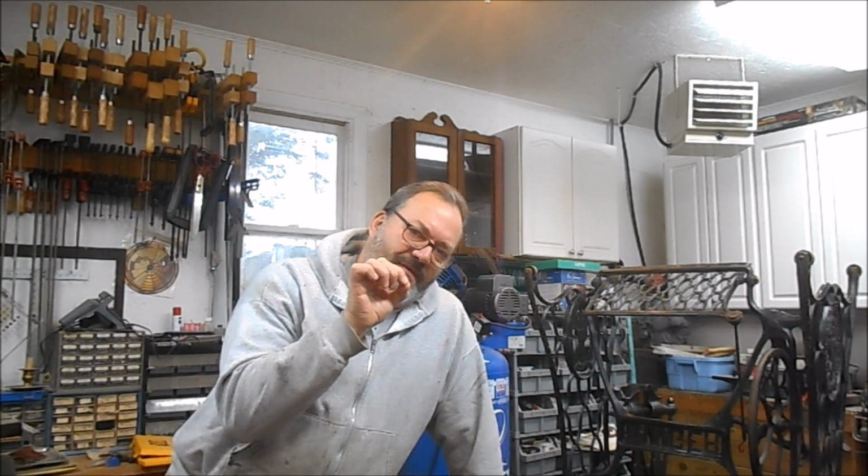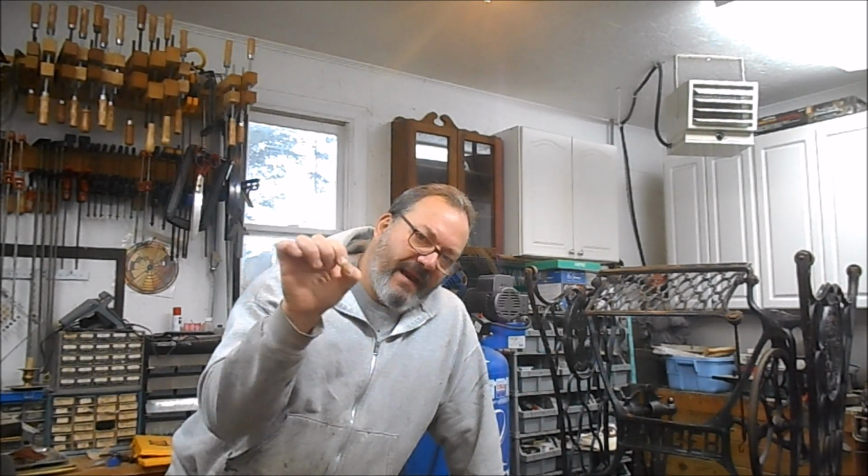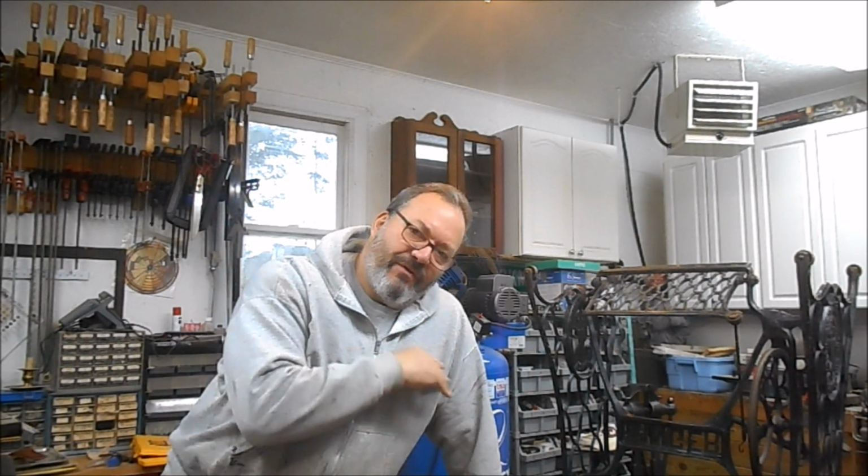There were just a couple of small spots that I had repaired that needed some graining work. I should have brought you along, I'm sorry, but basically all I did was take a black wax pencil and draw little faux grain lines on those areas, and then sprayed over them with the shellac, and they blend right in. It's not that big a deal.